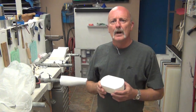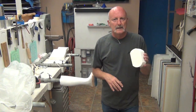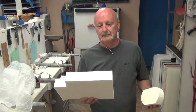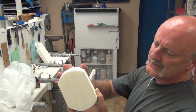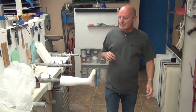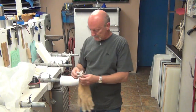Now I'm going to build up my toe extension. To do that, I use what I've always called Frittles foam — it comes in a 24 by 24 sheet, typically about an inch and a half thick, typically used in prosthetics for a soft cosmetic cover. I like it because it's super light, forms exceedingly well, and it's thick so you don't need a whole bunch of layers. Since it's very thick, you've got to slow cook it. I've got it in the oven set at 325 and it's been in there for six minutes.